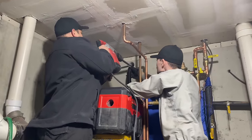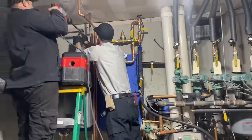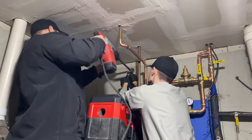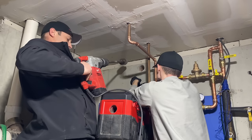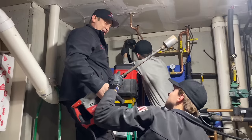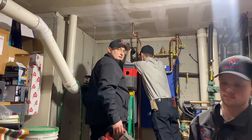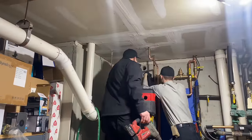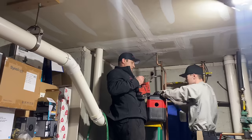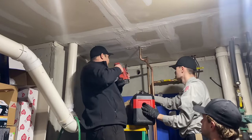You got brick? Yeah. All right, so pull that out. Vacuum out that hole. Let's get the pilot bit on the other hammer drill, which is somewhere here. I don't know where it went. Oh, there it is. Vacuum out that hole as best you can, and let's shove that pilot in. Don't touch that, she's hot. There's a hole there already. You want to get that hole, and you may have to take that grip off.